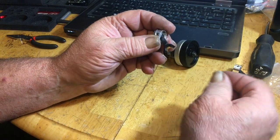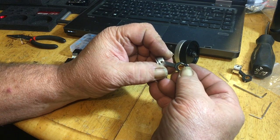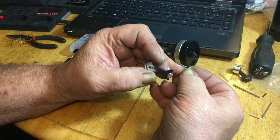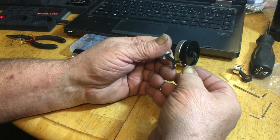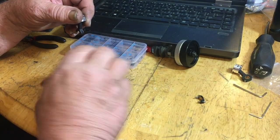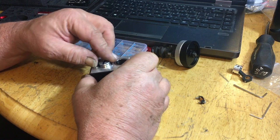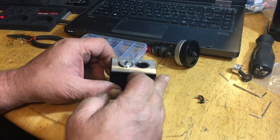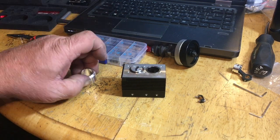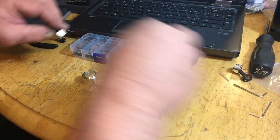You see I've got the rod cap off. Now I don't want to put it on this way because the tab hole is on the bottom. Now we got the two tabs lining up. So what I'll do is turn this around and I'll put this piston in like so, this way. But we have a tool for this. So I'm gonna get the other piston ring on and we're gonna do this up.